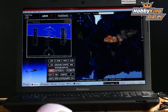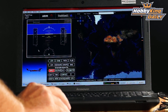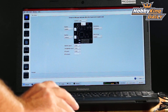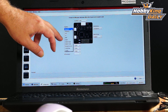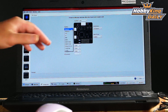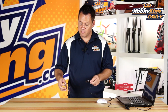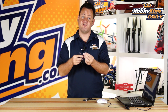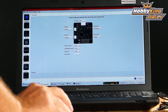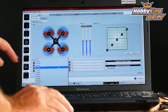You really don't need to know how to set that up — it walks you through it. The GUI is extremely easy to use. Jumping to the flight data screen, you can see the heads-up display showing the multirotor orientation, yaw, and various flight information. Under Configuration, I was mentioning the flexi ports — you can drop down and select telemetry, GPS, I2C, PPM in, CPPM in, DSM2 satellite, DSMX, or debug console. Lots of options for these inputs, plus the standard input cable for single-wire receiver connection.